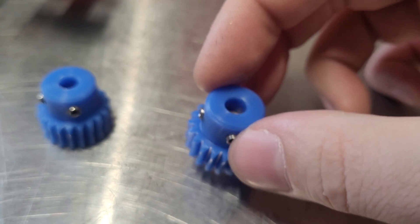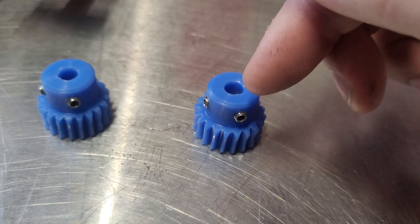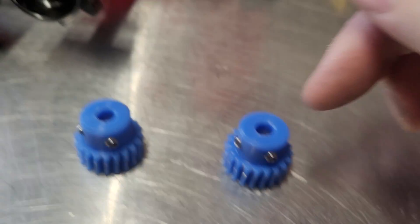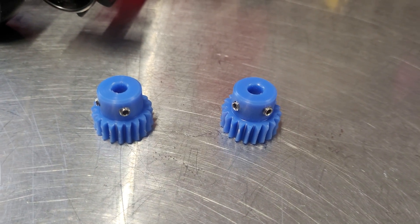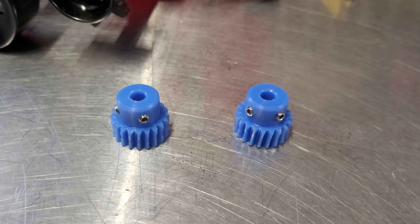These nylon gears do not have enough thread power to push that brass sleeve to grip the shaft. So you have to make sure that the set screw goes on the flat spot on the shaft. And then also don't tighten them down very much — they don't need too much just to grab onto the shaft.